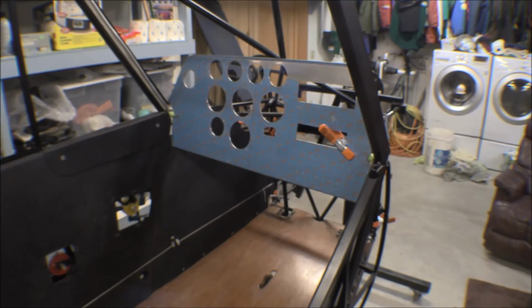I made some modifications to the bottom of that instrument panel, cut off a little bit of that lowered flange and trimmed it back a little bit, and then rebent that middle flange and increased the angle of the bend to about 60 degrees or so instead of 90 degrees, and it fits in there pretty good now. It just rubs a little bit on the Kydex on the side panels. I took a machinist level and leveled up the fuselage. I laid it across those two X braces that go from the forward door post and window post up to the engine mount, and leveled the fuselage up with the machinist level.